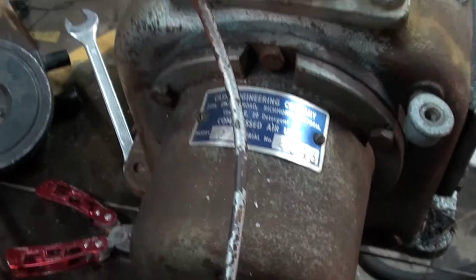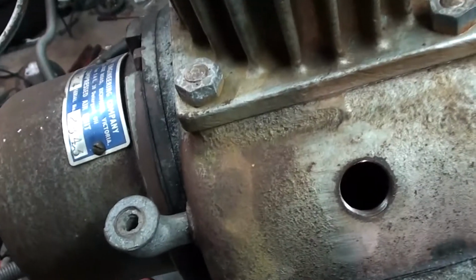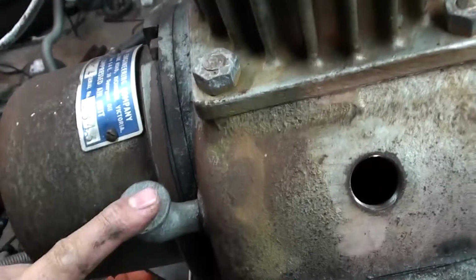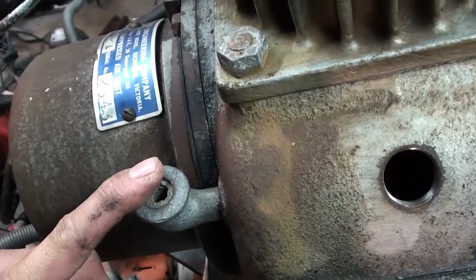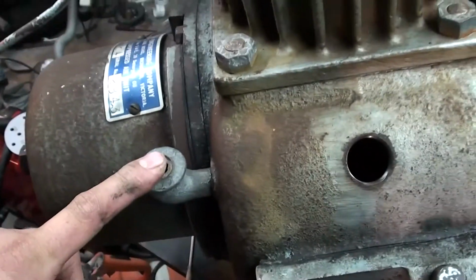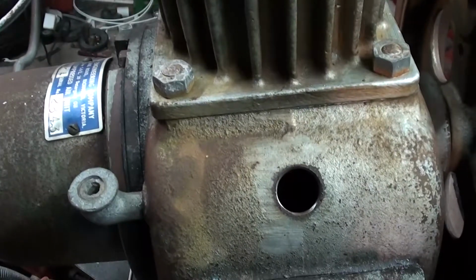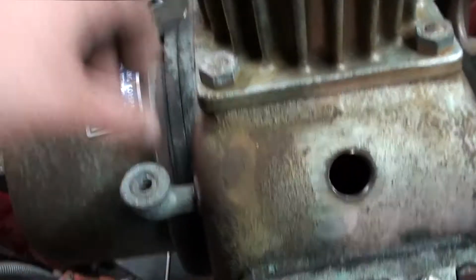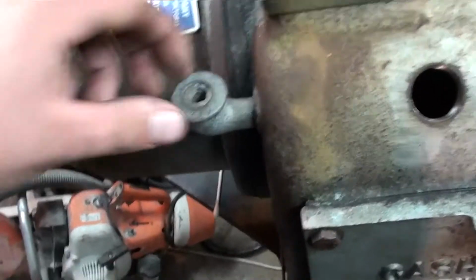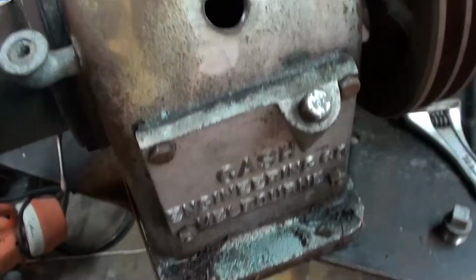But basically, by doing that, I'll be allowing for heaps of extra airflow, a good filter which is throwaway and replaceable, and somewhere to plumb the crankcase breather. If that's got to run up and over there, and I leave a constant grade on the pipe that comes down to it, anything that does blow up the breather has a good chance of running back into the crankcase, rather than blowing out a little vent. I'm not sure what was actually there originally, but I'm going to assume a little bit of vented mesh kind of stuff. So yeah, that's the plans.